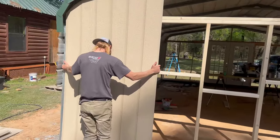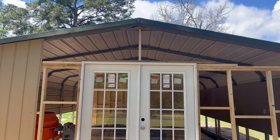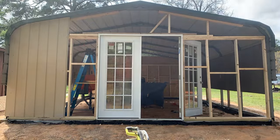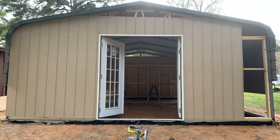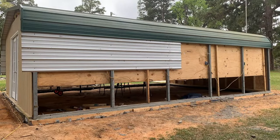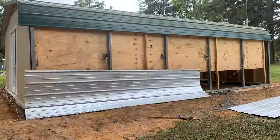Because the install of the French door went so smoothly, we had a little extra time, so we decided to go ahead and finish up the back wall with the smart siding. I started day four by taking a step backwards to properly secure the wall to the carport. To attach our carport to our studs, I mounted 2x4 beams using self-tapping screws to the carport, then attached our studs to these beams. To add more strength, I designed a series of triangles to help distribute the weight. After securing these studs to the carport, I finished the rest of our siding. The last thing was to reattach the bottom siding — I removed all the panels and reorganized them so the side with one seam faced the most visible side, then reattached all the tin.